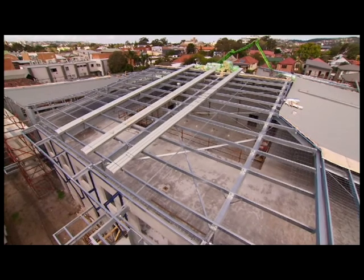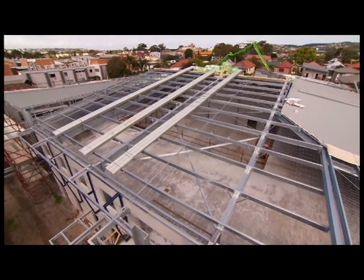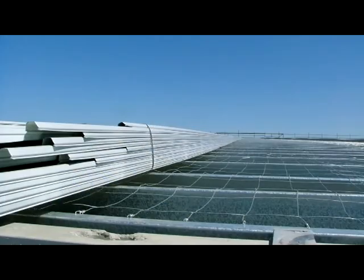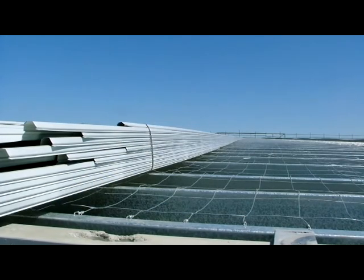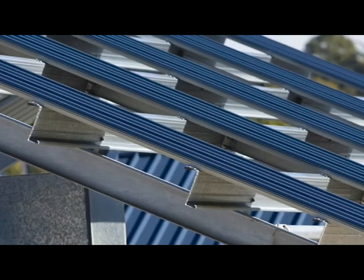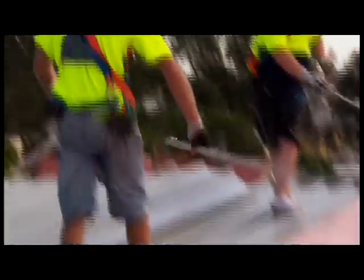Place bundles of sheets over or near firm supports, not at mid spans of the roof members. Supervisors should be aware of the safe stacking limit of sheets on the roof frame and plan where and how many sheets can be positioned on the roof.